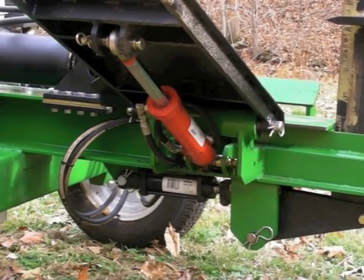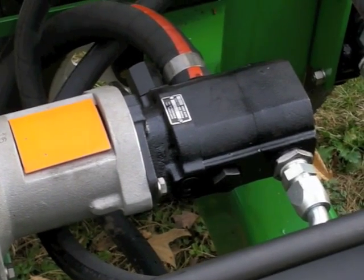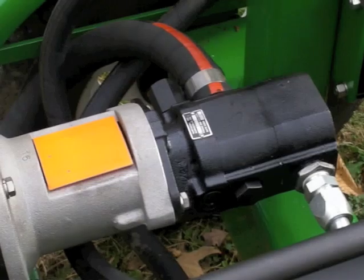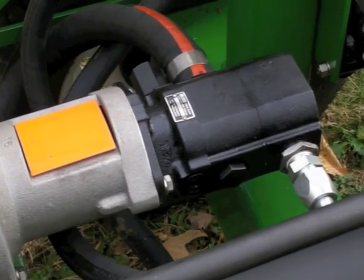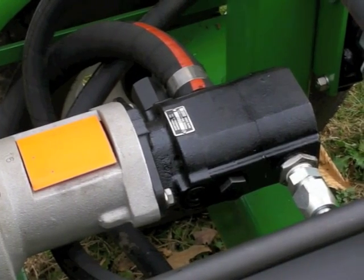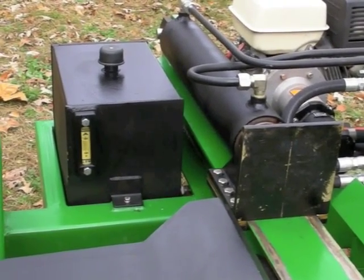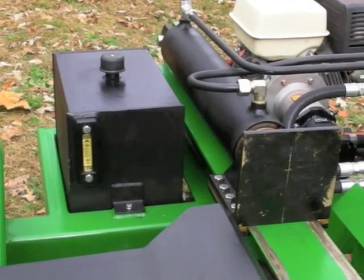As stated in the beginning, this is a 22 gallon per minute dual-stage high-low pump that has a maximum pressure of 3,000 PSI — probably bigger than you typically need for a log splitter — but with the 13 horsepower engine I tend to run it at about 2,400 RPM, about two-thirds its speed, which makes things a little quieter and more pleasant to work around. Having that bigger pump keeps enough flow going that the cylinder will cycle at a fairly reasonable rate. The hydraulics are fed by a 12 gallon tank, which seems to keep the temperature more than cool enough for normal operations.